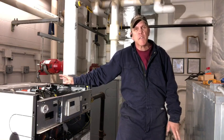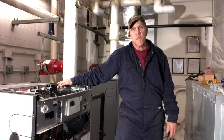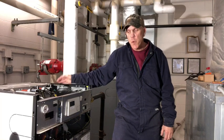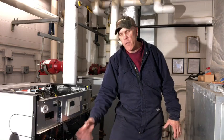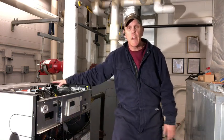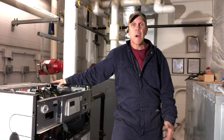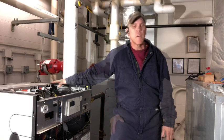The Fireside maintenance kit also comes with a yearly maintenance kit, which includes the spark igniter along with the flame sensor. Before you get started, you want to clean around the boiler, get all the dust and all the crud that's laying around the boiler, because you are going to be getting that floor wet when you clean it, and that way to keep you from having any kind of sludge or anything you may need to lay in. It also makes it a lot easier to find any screws or parts that you may drop throughout your day.